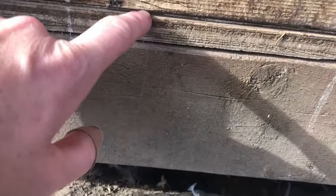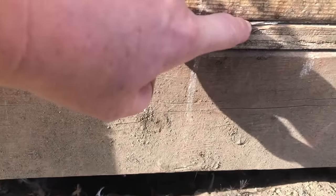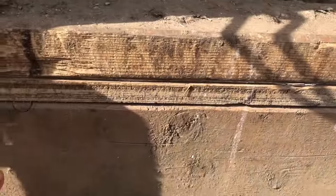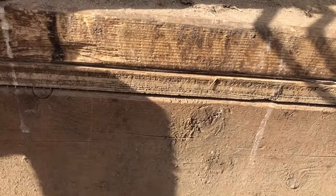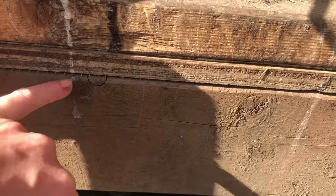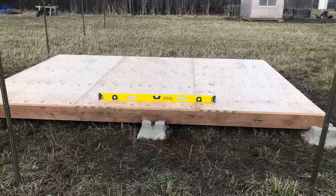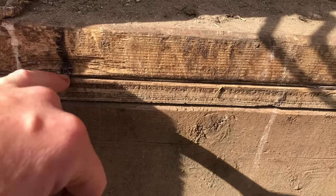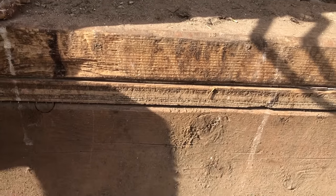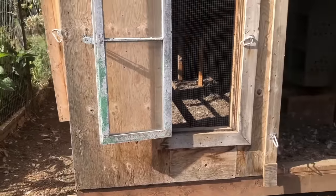It's what's cheaper nowadays — we used to just get linoleum. The reason why we layer it like this is because with chickens comes rodents, and so the wire at the bottom prevents the rodents from being able to chew up through the plywood and into the vinyl. Those are the steps for the floor, and now we will frame up.